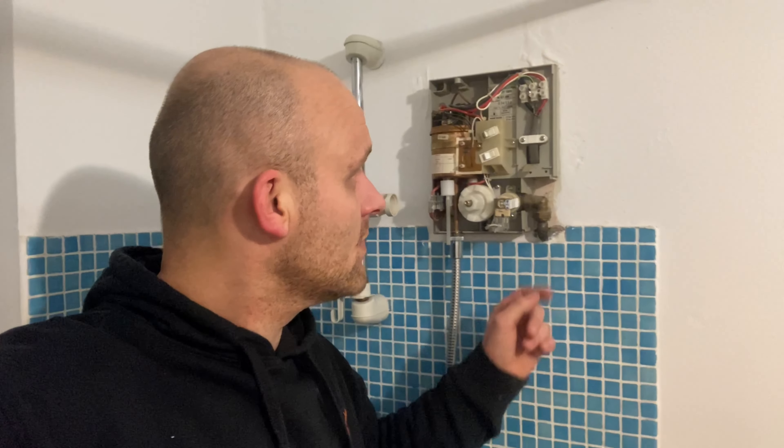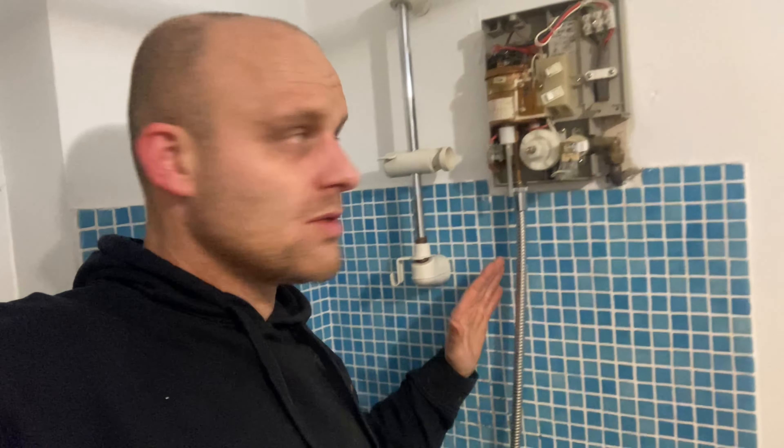I'd describe this as a localised instantaneous electric water heater — an electric shower. When you're replacing an electric shower, you've got to be quite strategic, because the cold water inlet is there and you don't want to disturb any tiles. Think about appearance. The electric supply is there too — everything needs to be enclosed so it's watertight, and you don't want to end up in a horrible wet zone. This is an 8.5kW shower, so you have to change it to the same rating, and always inspect the cable as well.